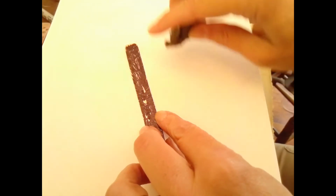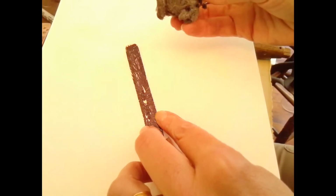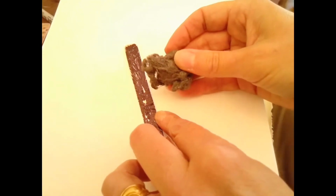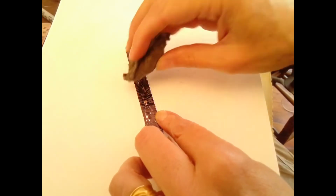Steel wool is awesome in jewelry and metalsmithing. It's really great. It polishes up your metal nicely. It also cleans off things like Sharpie marker. But it will make a big mess, so keep it in the tray. That way all the little crumbs and dust will be in there. Try not to blow it around or inhale any of the dust. Periodically we can empty the tray.